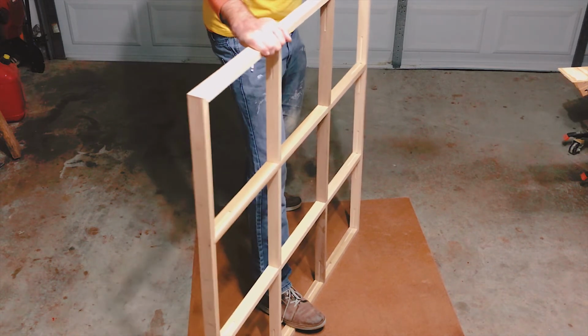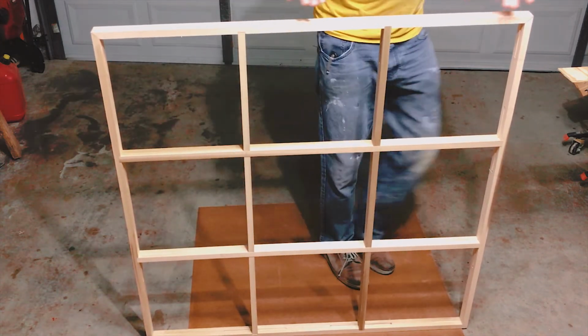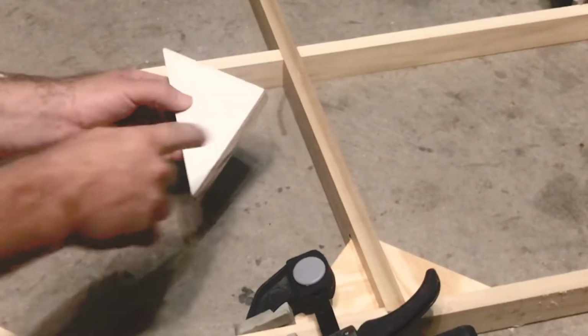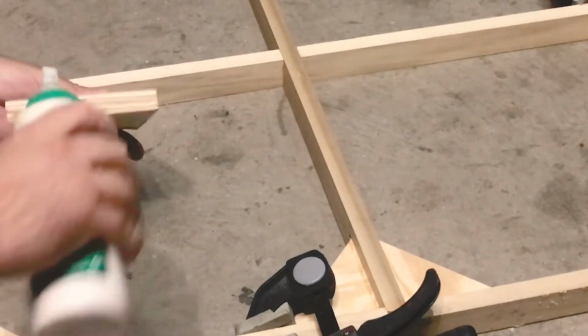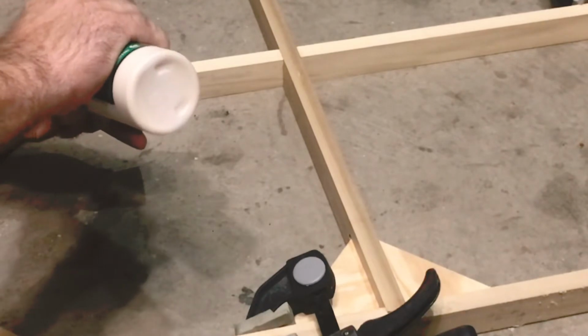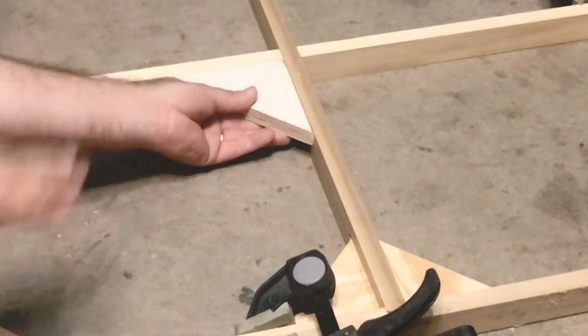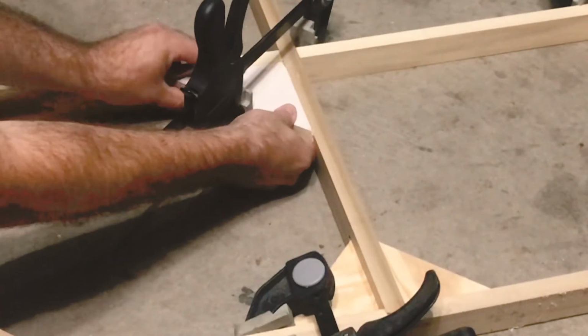Without any structural support, this is the amount of play throughout the cradle. That is way too much. These heavy 3/4 inch triangles will go on the edge of the cradle that is opposite of where the surface will be attached. Simply apply a good amount of glue and clamp it tight into place. Repeat these steps for the other 3 remaining corner braces as well.